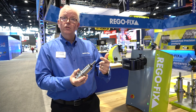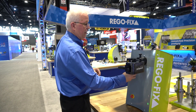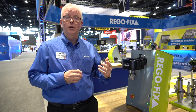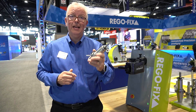As normal: cutting tool in a collet, collet in the tool holder. I open the door and put it in the machine just like normal. I press the button, and in this case six tons of force are applied to put it together. I get my tool holder assembly done in a matter of seconds.